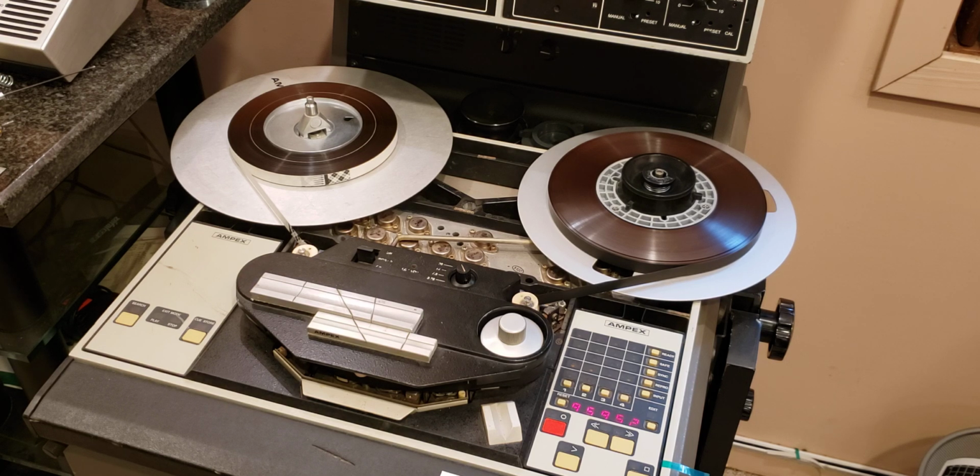You know, when components sit there for years and years and decades, they tend to accumulate dust and some particles on top. And when you subject them to higher than their usual temperature, they start outgassing, and you can tell it right away. When you have experience with electronics, you can tell it. It's not a burning smell again. It is a smell of components running hotter than they would normally do.